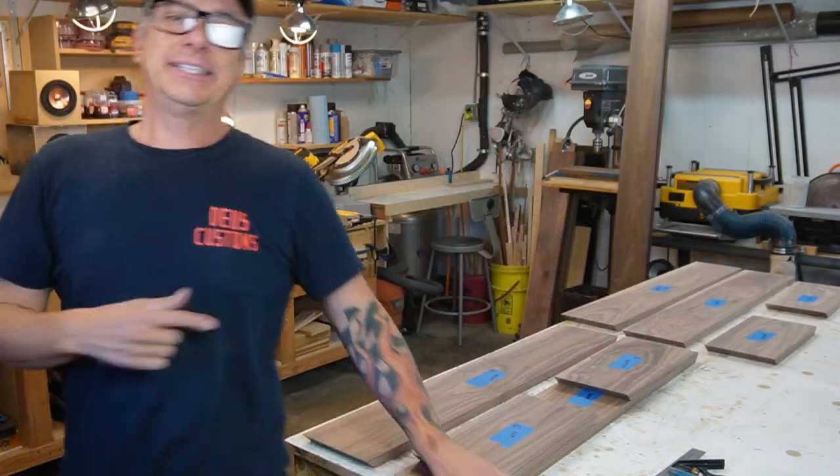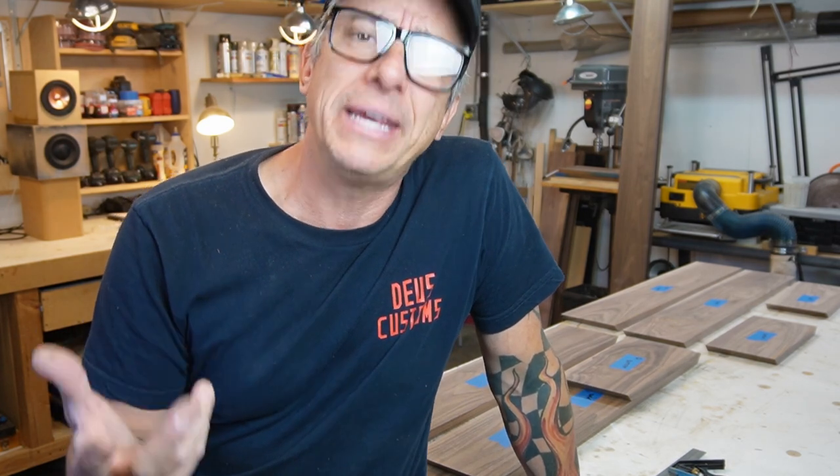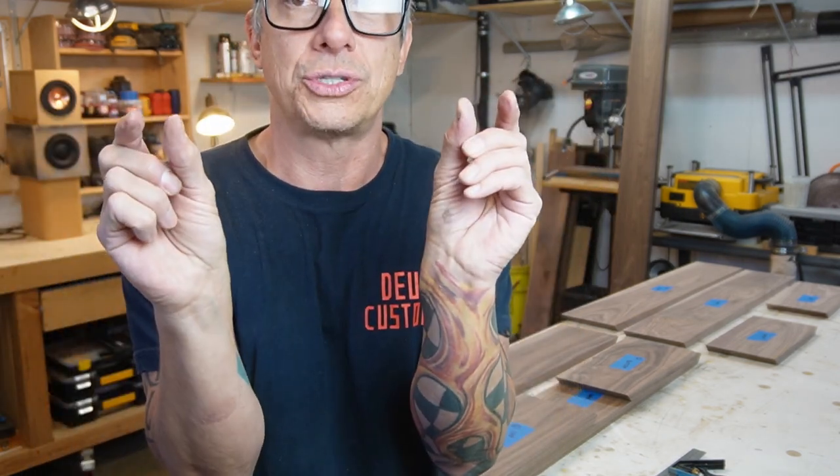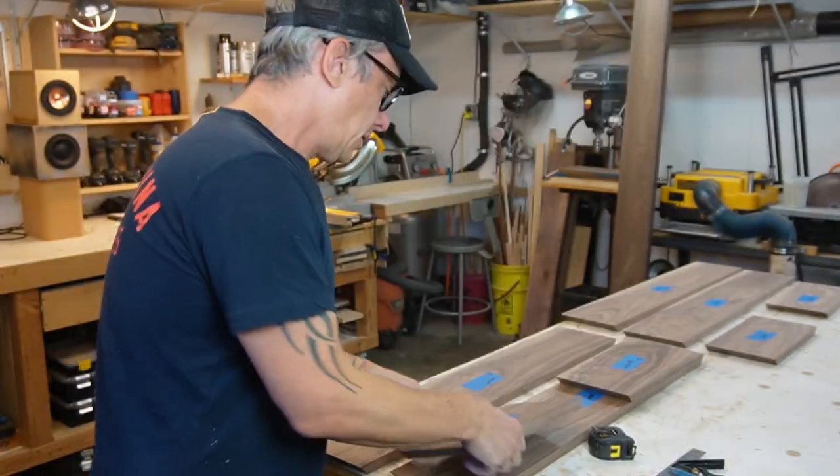Another thing, I didn't plane this wood. So this is not a 3/4 wood. Why? Because it's thick enough. I wanted it to be thick enough. The box ended up being a little bigger than my drawings. The way to reduce the volume inside is to use thicker wood, so it grows to the inside, so you have less volume inside. So I didn't care much about planing the wood, okay? I just left it to 2.1 centimeters. It's close to 7/8, which is good.